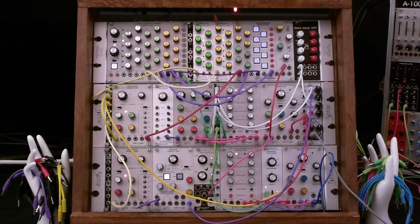The concept of this module is very simple. Add another column of potentiometers and another voltage output to the B1027 sequencer. The implementation is straightforward as well. The only variation on the theme is that in addition to the 10-volt outputs, you have a precision 2-volt output that allows you to fairly easily tune each step accurately by hand.